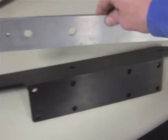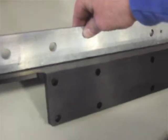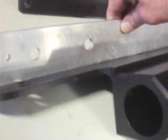The VLX base plate has an arc in the deck, and therefore the base plate must also have a matching arc. A straight edge across will provide a noticeable gap in the middle. This is only for the VLX or the 20MXZ. All other G3 mounted boats will use the standard plate — this one here — with a straight or flat plate.